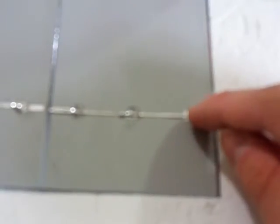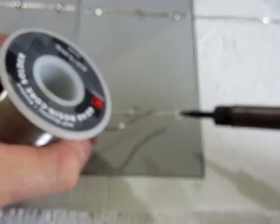Anyways, the third contact here, which was out of alignment, pretty much lines its own self up if you get the first two soldered up nicely. So with the third one, you'll just do the same as the first two. Just solder it down.